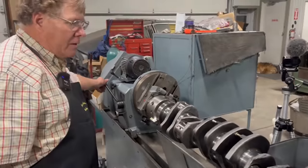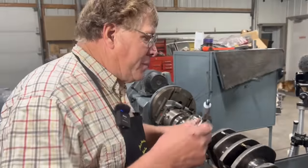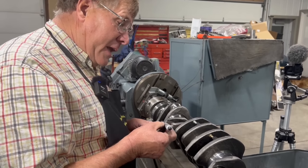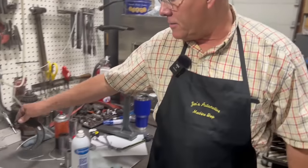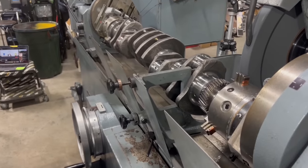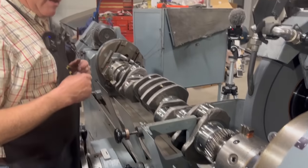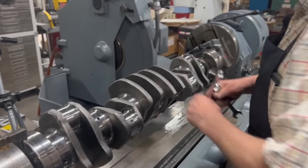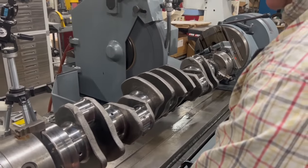With that, I think we're done with the rods. Alrighty. Feel better? I feel better. 3.90 and a strong 6/10. That's about where all of them came out. Sweet. Now what do you do? Well, now we gotta break everything down and move the chucks back to center line, and we'll be ready to grind the mains. You take all those out for? Yeah, we'll leave those out for grinding the mains.